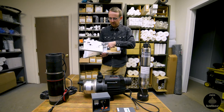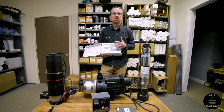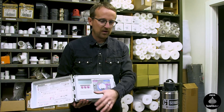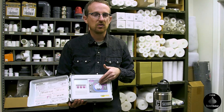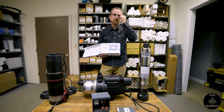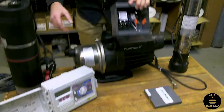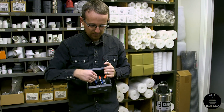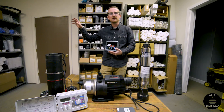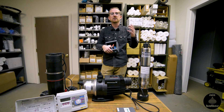Once you wire up your relay wiring into the irrigation controller, you set the controller to turn on your zone valves automatically like you ordinarily would. Assuming it's wired up with the relay correctly, every time an irrigation zone turns on it's going to open the solenoid in your irrigation system and also send a signal to the relay box — just like a light switch, that signal closes the circuit and turns on the pump. Automatically, as soon as that zone valve turns on, it also turns the relay on to turn the pump on, so you'll have pressurized water.